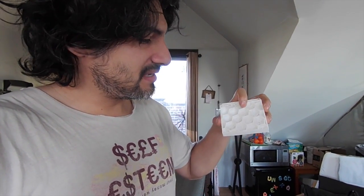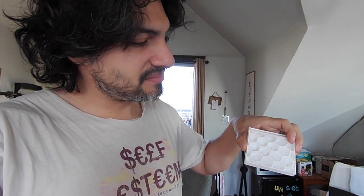Morning time. We wake up to see the print. Looks good from this side and from that side, except the top portion did not print because the infill was so wide that the filament going across could not create what we call a bridge, and so eventually it just failed. Which is sad because that is the very end of the print.